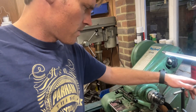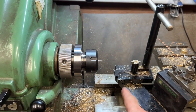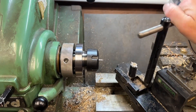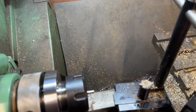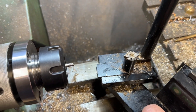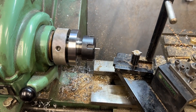I've had a hunt and I've found some grinding paste, which leads me on to talking about my ball turning attachment on the lathe. As you can see, there are a couple of bearings in there — you set it to the radius you want, touch it on the outside, and just turn the radius on the end. I've put my own rudimentary scale on there — I know it's a bit rough, I did it a long time ago — but I've already machined the rod to the same diameter as the ball and we'll put a little radius on and see how it works.